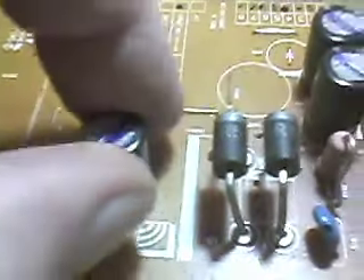It's a brushless DC 5-volt fan, so it won't give any interference to the circuit — it uses its own internal oscillator. I've had to put it at an angle because there's not much room, but it can draw air in from the side. Hopefully I won't have the same kind of problem in another five years. I've already proven this approach on my Panasonic VCR and it works well, so no harm trying it here.